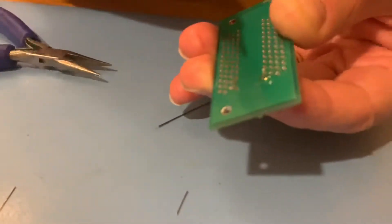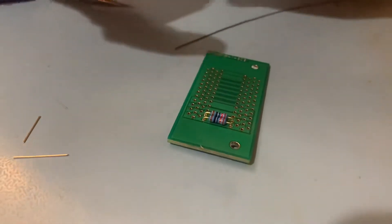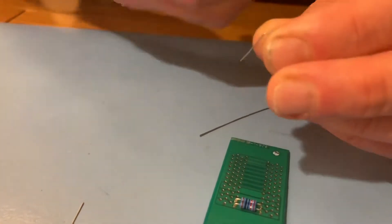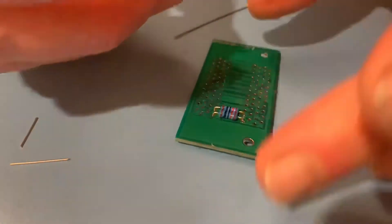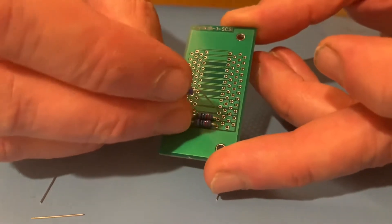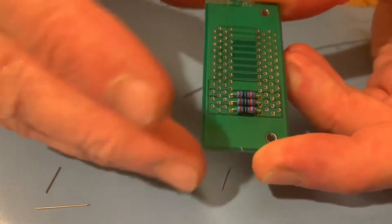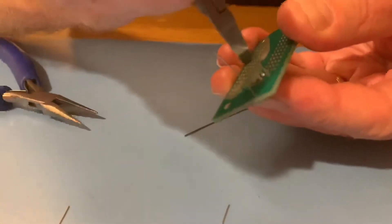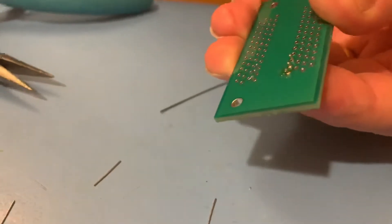Tin your iron again and just tap that one in. I'll pop one more in so you get a bit of sequencing — it really stands out clearly. Bend it, body in the center. There's a reason I like it centered: if you have it too far one way, the long part can bend down and touch the board, risking a short. As you can see they're all nice in a row, bands all the same — that's what I like to see. Crop them down and add a little bit of flux again.